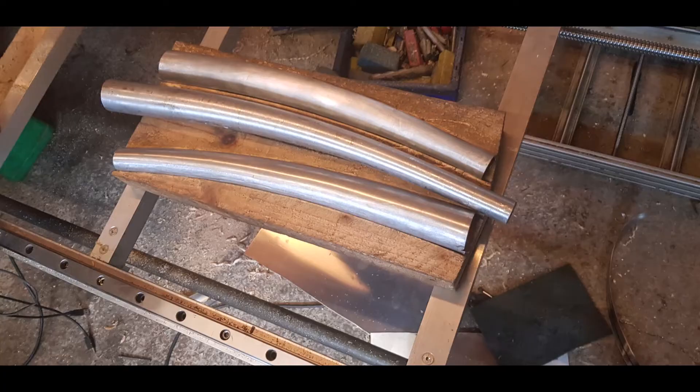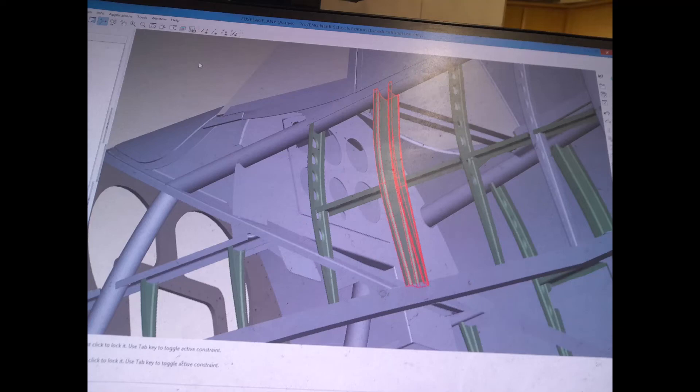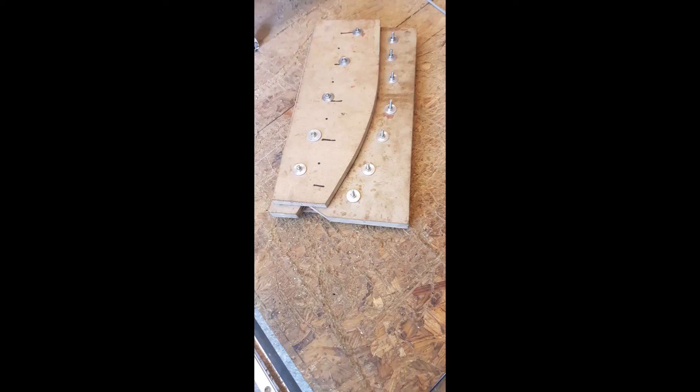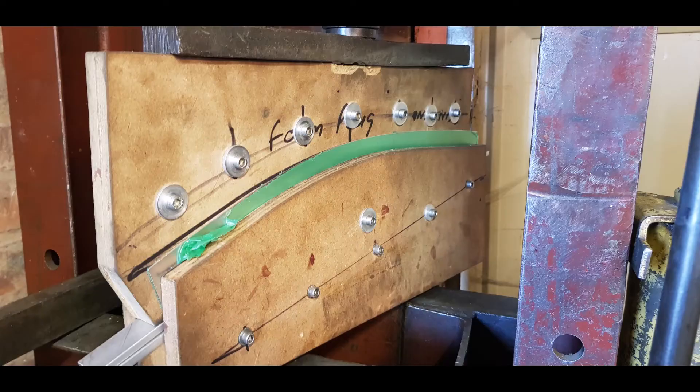In all, a time consuming and expensive manufacturing process. There are a number of frames that provide the contour form for the cockpit skin. None of the frames are continuous, there being no floor as such in the cockpit section itself. In reality, only the channel frame D provides any structural continuity along with the longeron extensions between the upper and lower longerons.